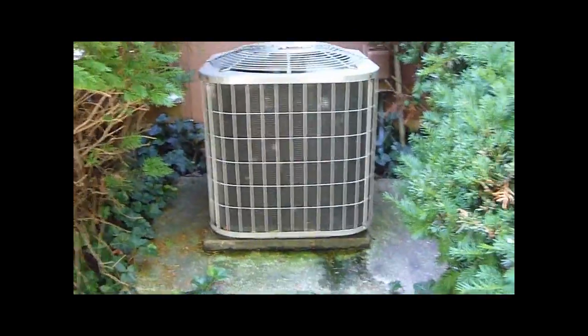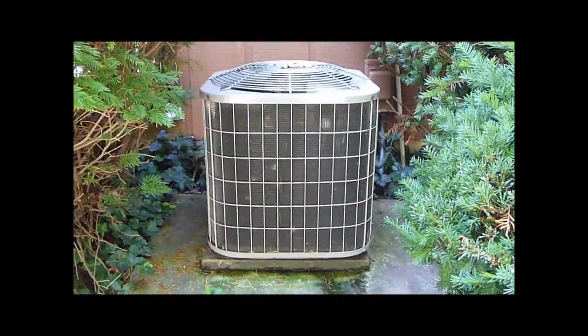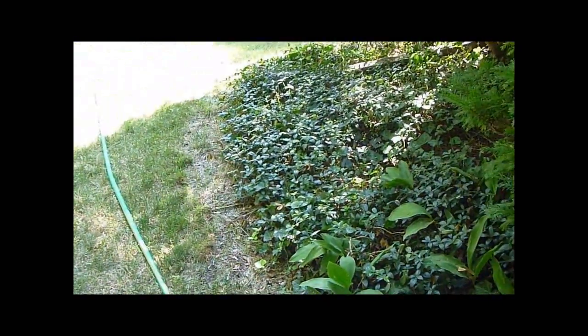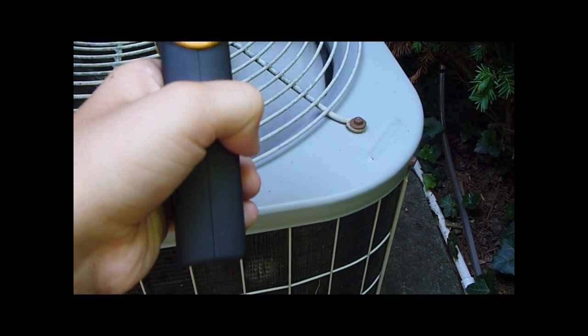Here is the carrier. It is running under an extremely high heat and humidity load. It is Thursday, July 21st, 2011, about 4:30 PM. It's about 96.9 degrees in the shade on the dirt, and in the sun it's about 110–111.7 — a steady reading, so it's pretty hot. The condenser temperature is pulling in about 109 degrees air; the output air is about 119. It's about 60% humidity right now and the heat index is 112.